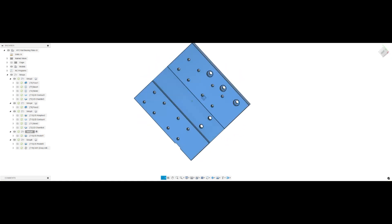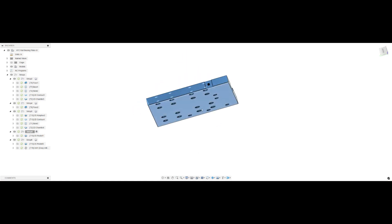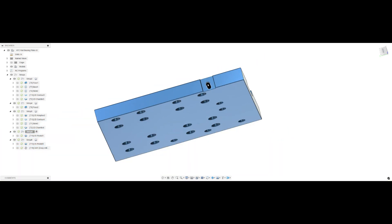It's pretty straightforward as far as its machining. It's got some pockets in the back and then all these through holes for the screws going into the bearings, a through hole here for the air cylinder mount. There's also a threaded hole here at the end, but I'm not going to be able to thread this on the machine because the plate is physically too tall once it's clamped in the vise. I'm able to machine this pocket and drill it, but the compression tapping head length is just too long, so a thread mill would be much better suited for this area.